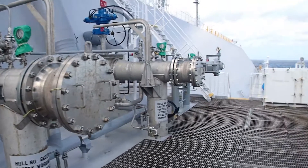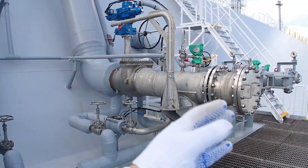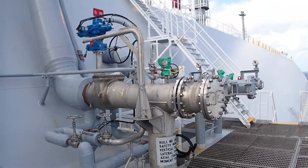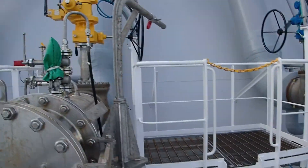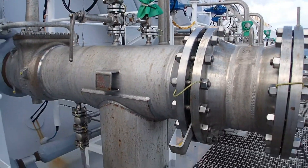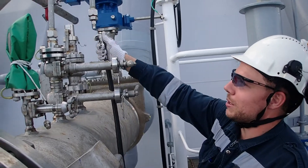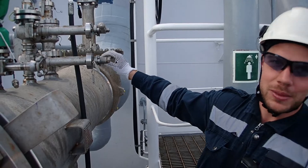After performing the task, the area between the ESD valve and the SDP — the short distance point — needs to be pressurized. In order to do that, a nitrogen hose is used. It's connected on the top here at the production point and it's pressurized inside this area. Now we go connect the nitrogen and we will pressurize our line from the ESD valve up to the flange.